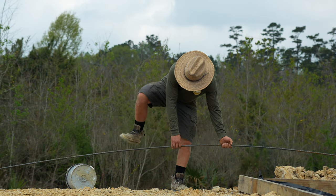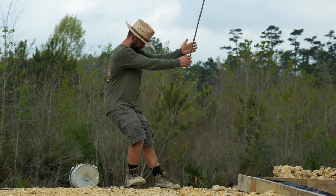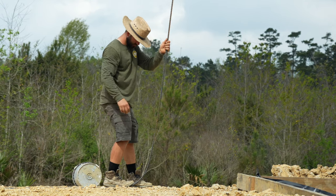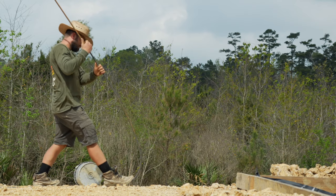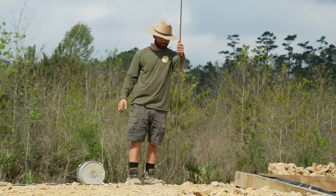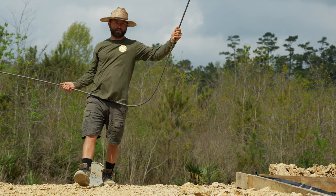You can bend half inch and thinner rebar pretty easily without special tools. Any bends in rebar need to be rounded. Do not make a hard 90 degree angle. Most code calls for 5 rod diameters for the length of the bend. With half inch rebar, the bend should take place over no less than 2.5 inches.